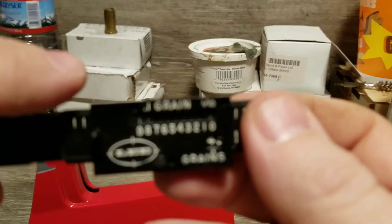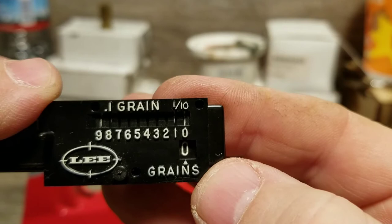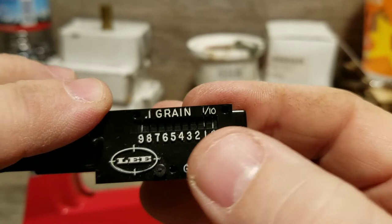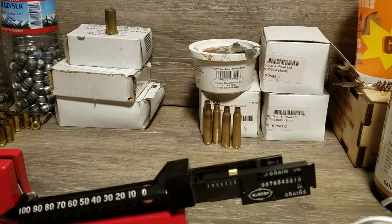To zero the scale I pop out my lock and move the slider until the zero is in the grains window, setting it so the nine and one have faint lines and the zero has the heavier line. Now that is zeroed, and I push in the button to lock it. This is literally how I set it, because when it's sitting on my table I can't see those little lines, so I pick the beam up and hold it up to my eyes.